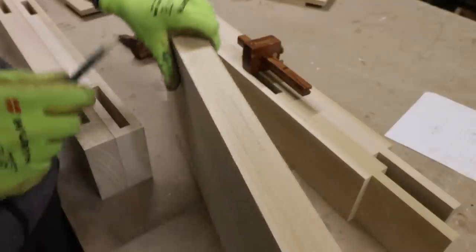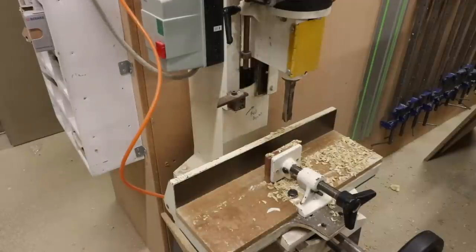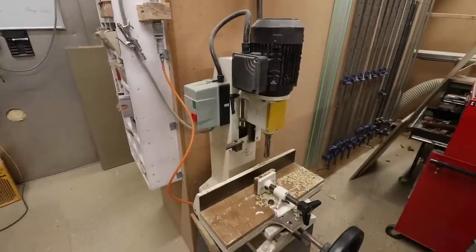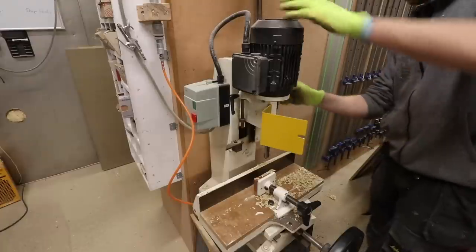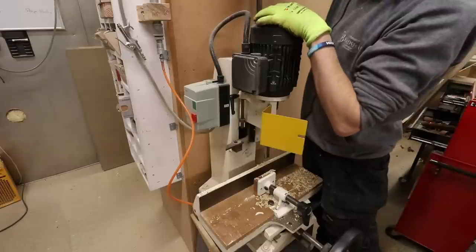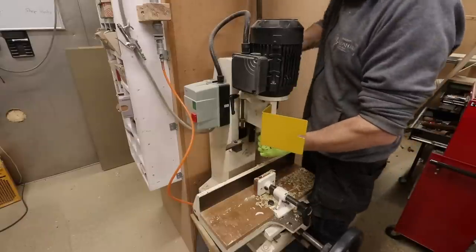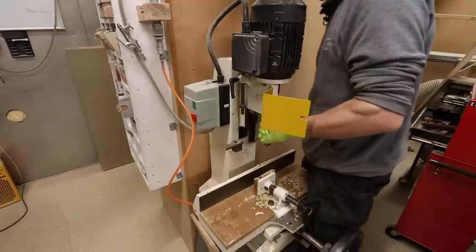And we want to mortise that as accurately as we can on the machine. You're going to have to lift the head of the mortiser up. Again, that's another point where there could be an inaccuracy. As we slide this head up on the face plate here, it could sit slightly differently on it and cause another inaccuracy in the positioning. So it's another reason why we want to have that gauge line there just to check.